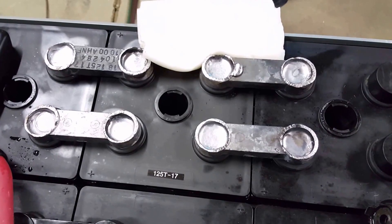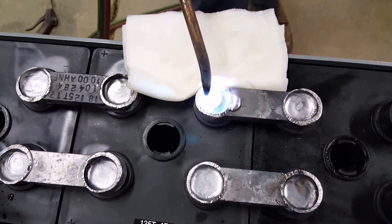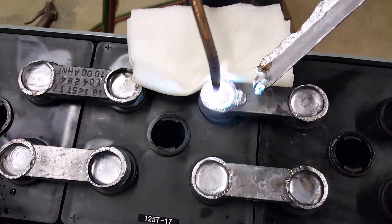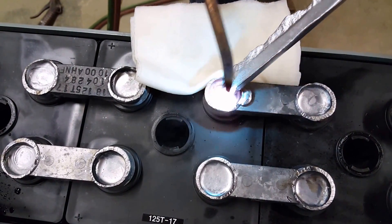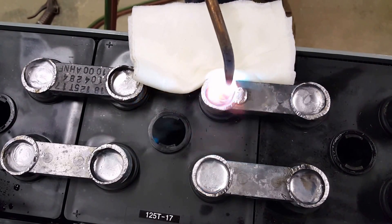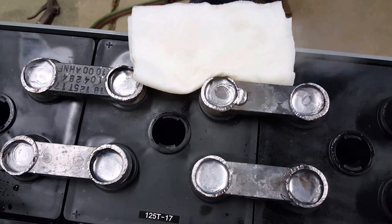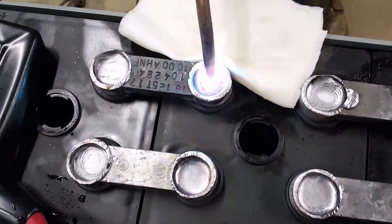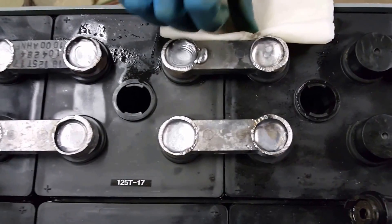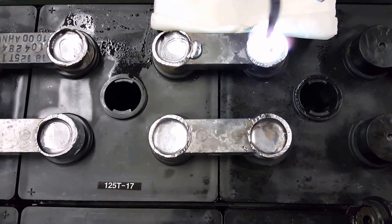The thin ones — the sides started to melt down a little bit, so I've got to get it heated up again, and then I'm going to put some liquid lead in there, always making sure that I have a liquid pool in the middle. As soon as it starts to harden and I put liquid lead on top of it, we're not getting very good connection and we just end up pancaking everything. This one hadn't melted down yet, but it's getting pretty close, so I'm going to get my rag in there to make sure it stays cool enough.